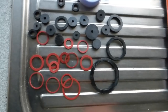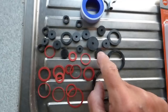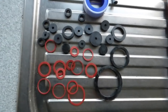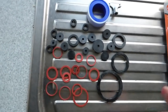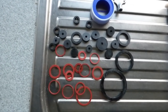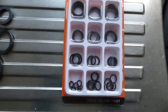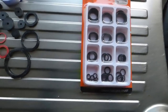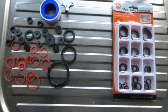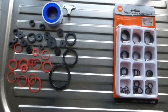These fiber washers that fit around the base of taps — you can get those to fit too. The ball valve washer is probably more of a low-pressure type, but at the end of the day you can always cut it down for a high-pressure one, which is a bit smaller. There are lots of useful things there. For the money, just buy them, stick them in a drawer somewhere out of the way, and I'll guarantee you'll need this washer pack at some point. That, along with this pack of rubber O-rings, is a nice little bit of kit to have in your filing cabinet, tucked away in the garage, or if you're a plumber, in the back of a toolbox ready for a dire emergency.